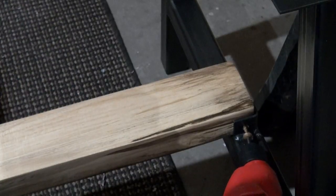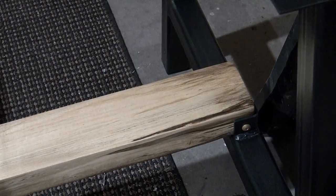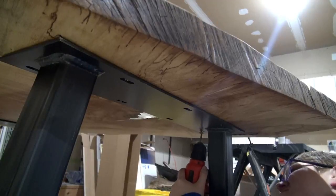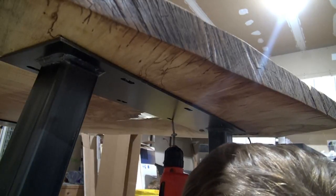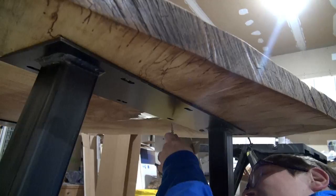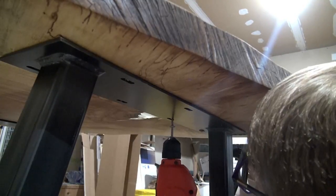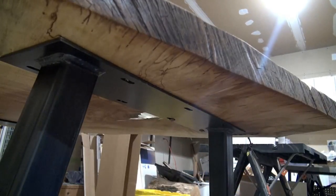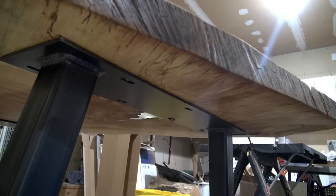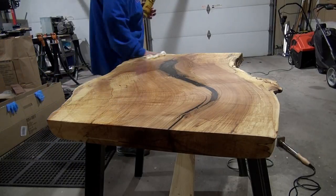And then it was time for assembly. I just went to Lowe's and picked up these construction lag screws — I figured they would be best. I did need to pre-drill, though I'm not showing that here in the video, but I did pre-drill for the assembly of the beam and for screwing into the top. It's pretty slick using the lag screws. And you'll see that the leg plate there has slots in it, and that's to allow for wood movement — so as the wood expands and contracts with moisture, the screws can move also, and you shouldn't get cracks in the top.